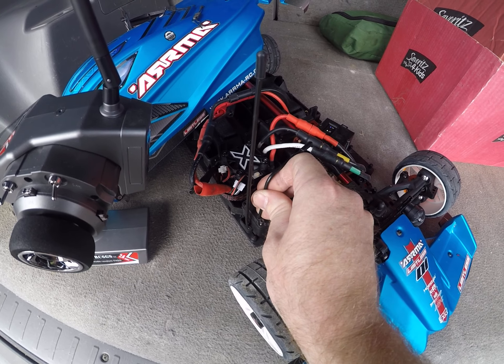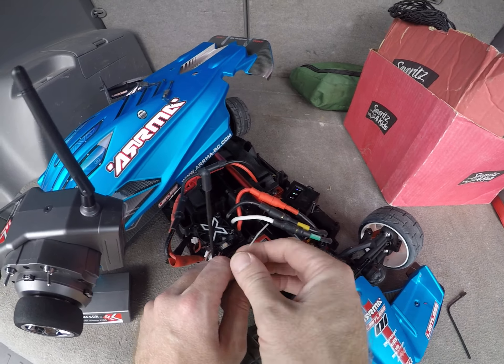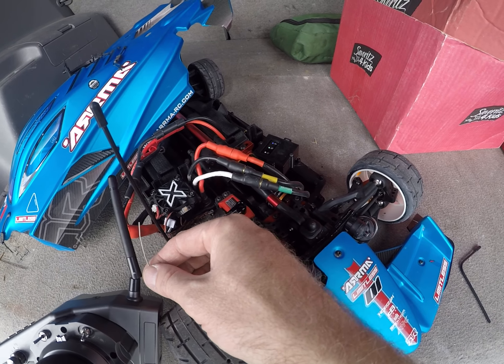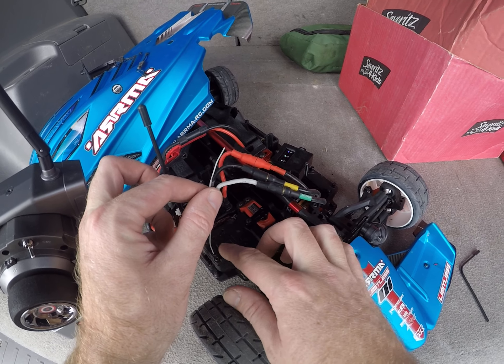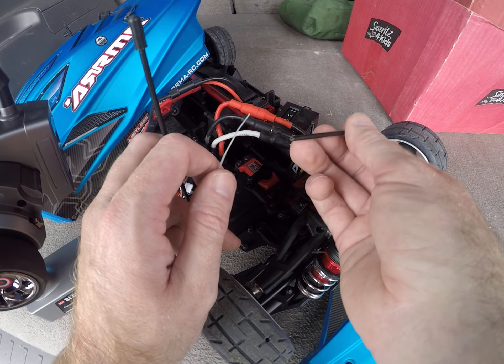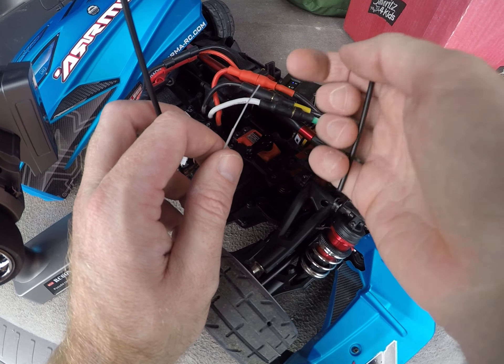One interesting thing: the antennas that come with the receiver are really long. The unshielded part at the end is sometimes referred to as a whisker, and it's tuned to be about one quarter of the length of the antenna on the transmitter. All the length of the wire isn't actually receiving anything — it's the whisker at the end doing the receiving. It also needs to be really straight; if it's bent, it won't work as well.